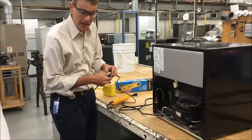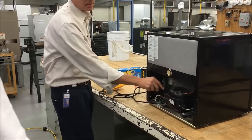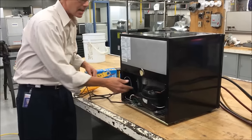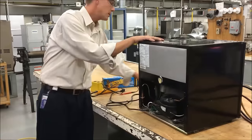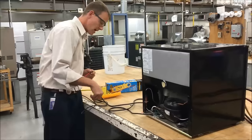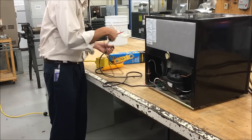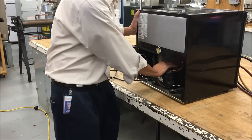And then there's one more circuit that sometimes has a capacitive circuit. Where's that switch at inside of this? Behind this black case. If I pop this cover off the black case, I'll see two switches — some sort of relay, a potential relay or a current relay depending on what it is, and that overload switch. And then the other switch would be the thermostat, so that's pretty much it. It's not grounded — can I plug it in? I can safely plug it in and it should fire up.